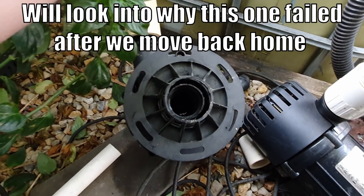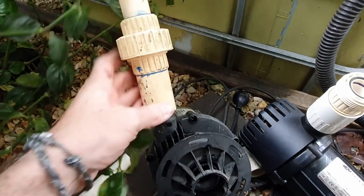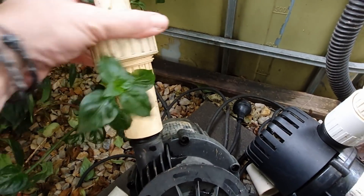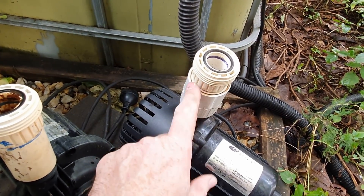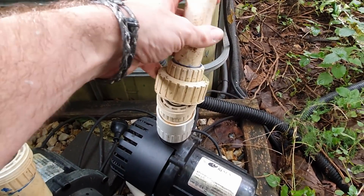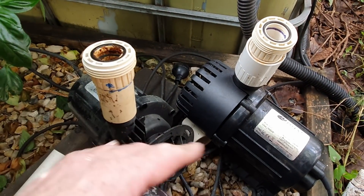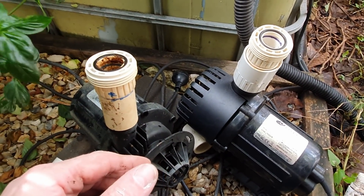And this is the other one. I'm not too sure what's wrong with it — it wasn't clogged or anything. The way I've done the plumbing, which might help a few people out, is I've tried to make everything universal. I've used a 25mm to 40mm reducer — or expander depending on which way you go — just so I can thread on this barrel union, and it also goes straight on to this 20mm. I found the most common sizes with the pumps I buy are either 25mm or 40mm, which is one inch or an inch and a half.